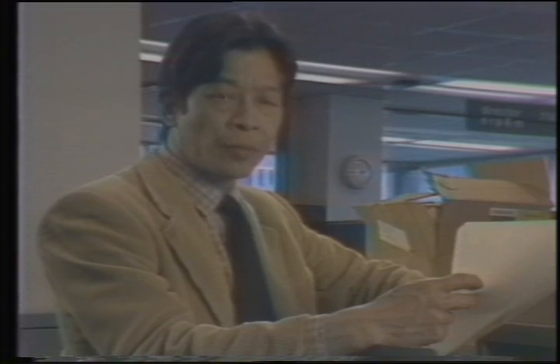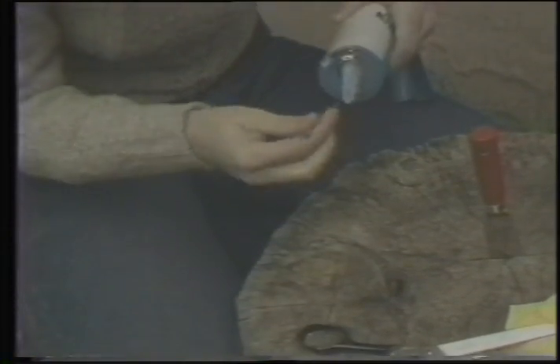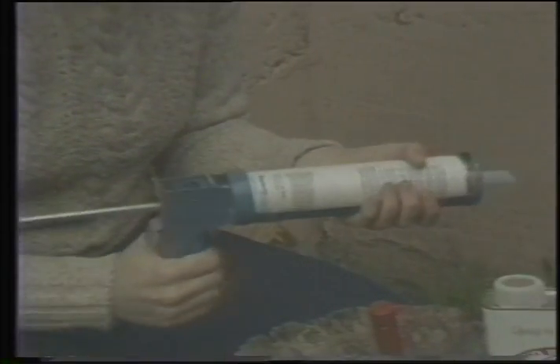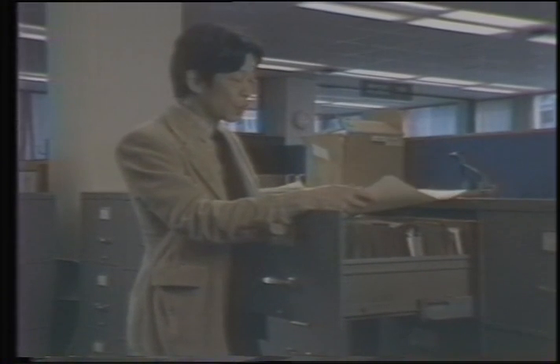To determine the proper method for caulking, we had Jane Doe reenact the scene. Using Exhibit B, the scissors, she snips the tip of the tube at a 45 degree angle. To get the caulk to flow, it might be necessary to stick a nail in the tube. If the opening is too big, the caulk will flow out too fast. Next, with the help of Exhibit D, the solvent, she cleans the area to be caulked. Then she takes the gun and runs the caulking along the area, making sure it touches both sides of the crack or opening.